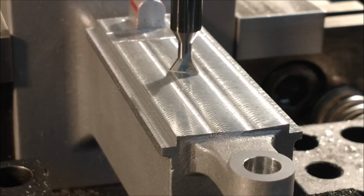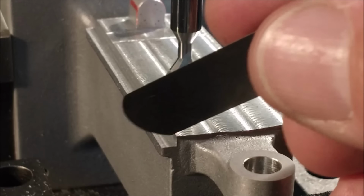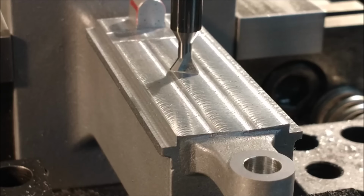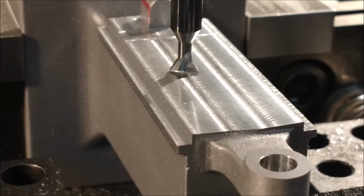And it is at this point that you need to decide which two surfaces you're going to use to mate your dovetail. If you're going to use the top and the edge, well, it really doesn't matter how deep you go with this. If you're going to use the chamfered edge and this face back here, well, then you better stay a thou or so away, because trying to get three mating surfaces on a dovetail is just this side of impossible. And usually you only need two anyway. So I'm going to start off with about a 120 deep cut here and see what I come up with, and I'll make that call just before I make the final cuts. And I may also explain what I just said on paper in a minute, so stick around. Here we go.